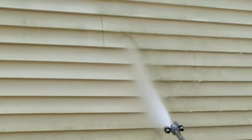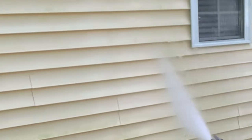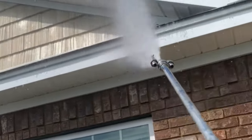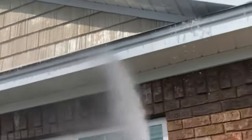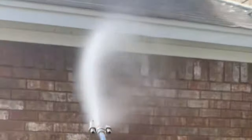This way they don't think oxidation damage is something you caused with the pressure washing or soft washing process. If they're not home, pull out your phone, make a quick 15-second video with a brief explanation, and text or email it to them — just a little added CYA for you and your business. Managing customer expectations is absolutely critical, but it also opens up the door for you to upsell the service. You've established that they've got an issue, it's outside the parameters of a normal house wash, but you'd be more than happy to give them an estimate for the oxidation removal.